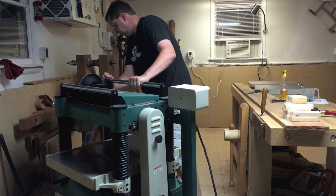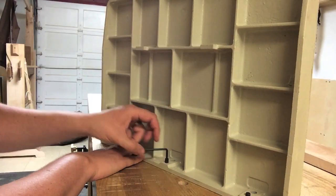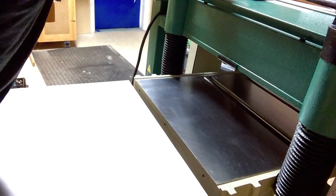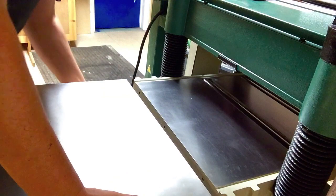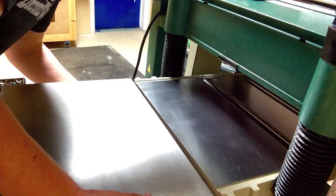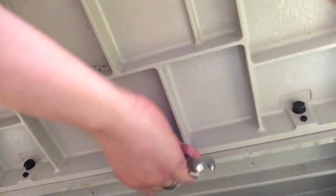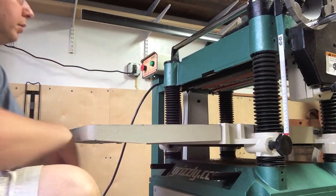With that done, I moved it into its final home up near the garage door and began the assembly, putting in the set screws on the bottom of the extension wings. I set the extension wing on a stool and then just lowered the base down so that I could line up the bolts hands-free without having to balance this heavy cast iron wing while threading bolts through. I got it somewhat snug so that it held on its own without support underneath, and then I had to go about getting it flush and getting everything level.